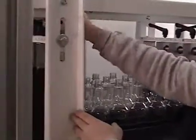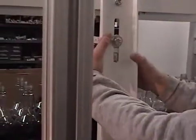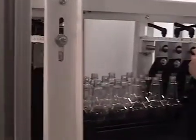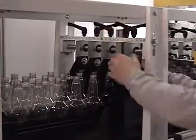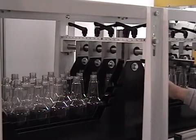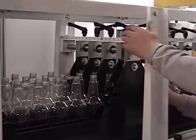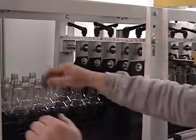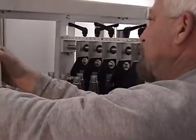Our lane guide assemblies now include easily adjustable kip handle units with a redesigned gauged hanger assembly. When you set them up at the shear line to the fin bar or to the wear gates, simply bring the lane over, match it up with the fin bar, then view the gauge and make proper adjustments to each tower with the exact dimensions. The assembly is very easy to adjust and securely locks into place once adjusted.